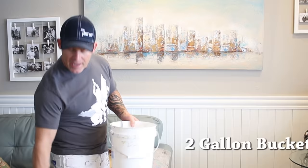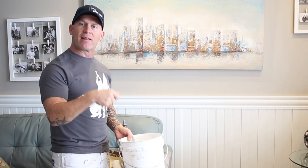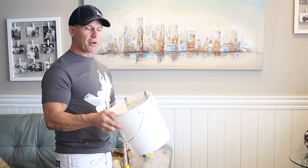The next item: if we're working painting in a bedroom doing ceiling cut-ins, I start off with a simple bucket. Every painter should have a cut-in bucket. I use a two-gallon bucket with a one-gallon grid inside. You never want to paint out of the gallon of paint itself — it can tip over a lot easier. These buckets have a sturdier base. You load in just about half a gallon of paint so the center of weight is lowered and it won't tip.